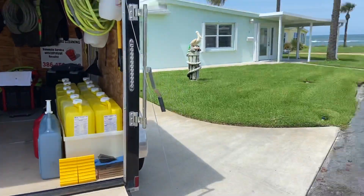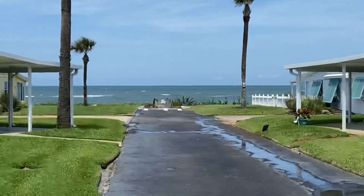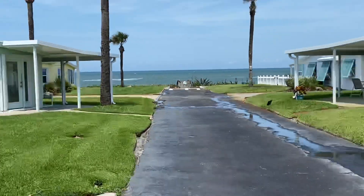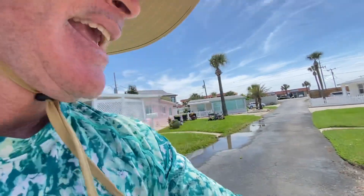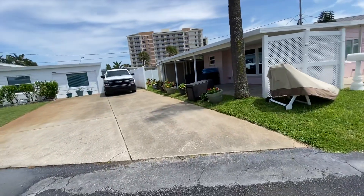It's a wonderful day on the beach — we've finished up a house wash and driveway. I've got some oxalic acid applied from control joint to control joint. Once that dries, I'll lightly mist it with water, agitate it with an acid scrubbing brush, let those salts reactivate, and it'll eat up the rest of those rust stains.